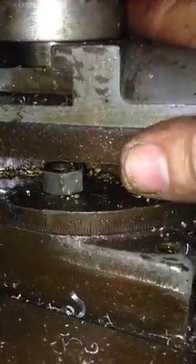We're gonna try a new technique here. Zero degrees off the hash mark is right there. So I'm gonna actually go into it maybe 10 degrees, maybe even 15. Let's get back in there - you see the hash mark, it's kind of hard to read those. That's 20, there's 15, so we're gonna do 15 degrees. We are going to lock that in on that side.